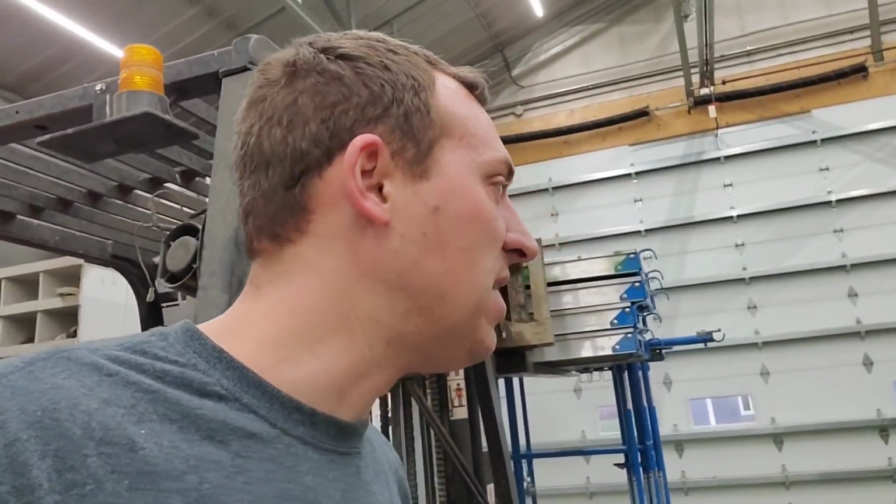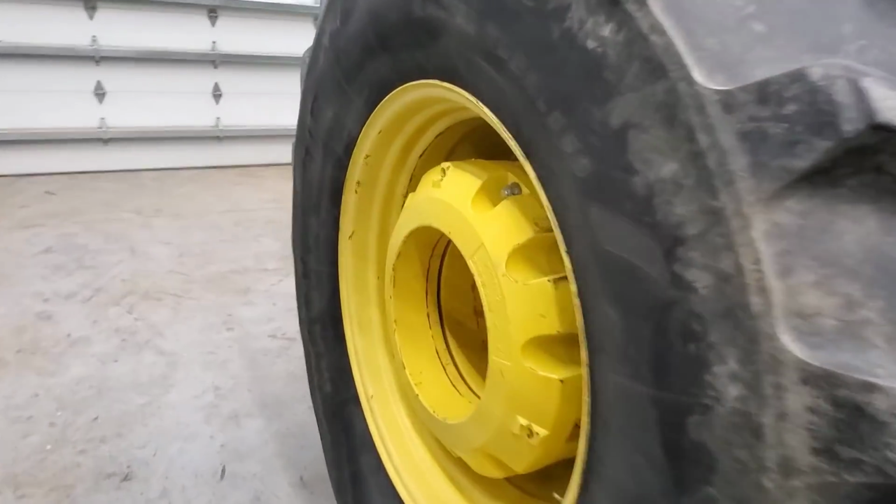So the difference is in the spring, when we're pulling a field cultivator with this, it's a big wide implement, and we pull it relatively fast, 6, 7, 7.5 miles an hour. So it's not so much that you need the power for pure pulling power and traction. You need it because you're going faster in speed. So we don't require as much ballast, as much weight, and we want to keep the weight as low as possible to reduce compaction, right? So you only want on the weight that you need. So in the spring, I will take weights off.